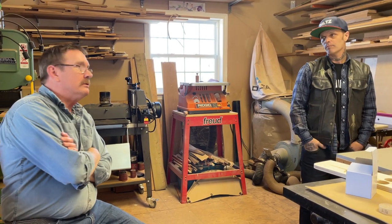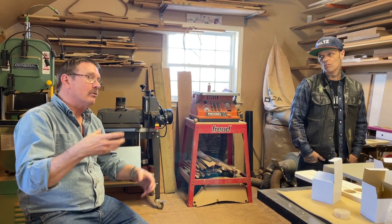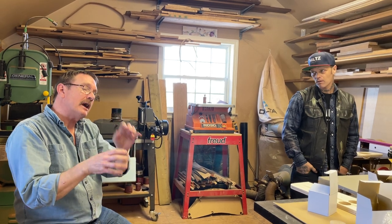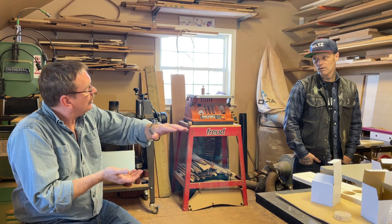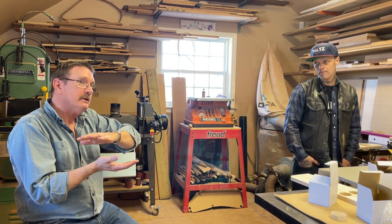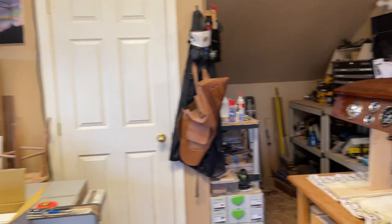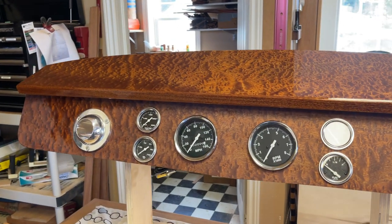So I'll take that all apart next. Give it a scuff sanding, like you were talking about with your primer. All I care about now is I've just got to scuff it enough, probably 220, so that the next coat, although with the urethane, this stuff works a lot like lacquer, so they melt together. Anything you add onto it adds to the one main thickness of finish. When you're working with poly, you're actually putting a coat over a coat over a coat. So when you sand down polyurethane, if you rub through that coat, you see the next layer underneath it, and you end up with witness lines. So I'll scuff that to probably 220 just so that it has something to grab a hold of, and then I'll build up enough finish that I can start to polish it. The dash top is pretty close to being ready to polish out.